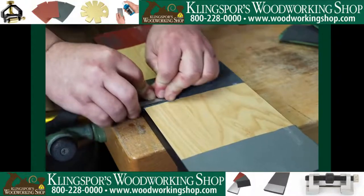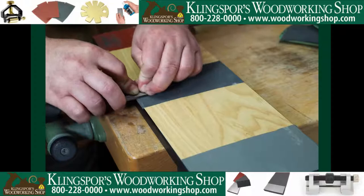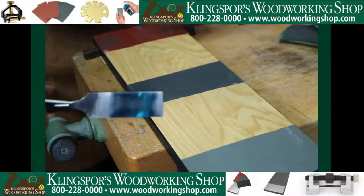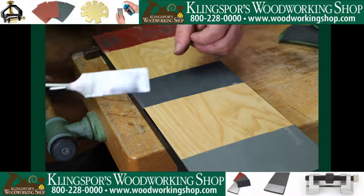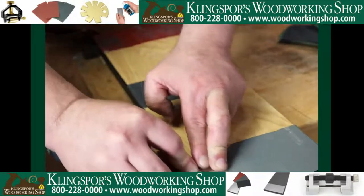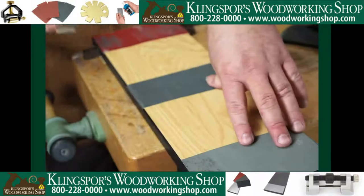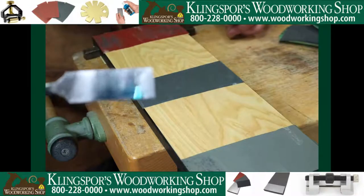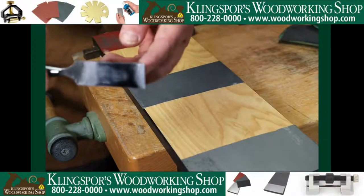Is there any pressure difference between the aluminum oxide and the silicon carbide? We talked about the silicon carbide being a sharper grain. You can see that's really starting to polish up now, except for a little low spot. If we continue on and hit this with the 1,200 — I'm not putting a lot of pressure, especially on the silicon carbide, just enough pressure to maintain contact with the sandpaper. On the silicon carbide, if we wanted to, we could switch to a lubricant, which would actually work better and achieve a better end result.